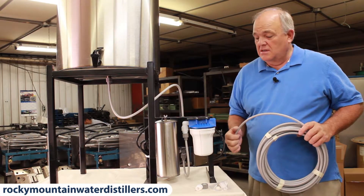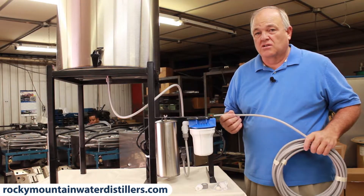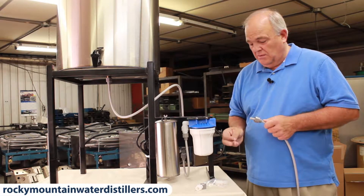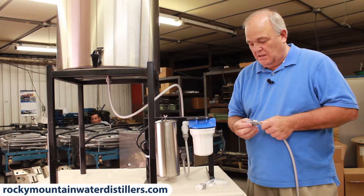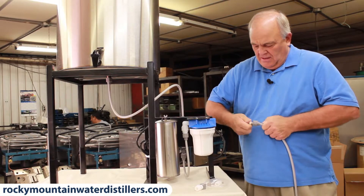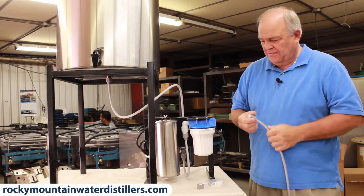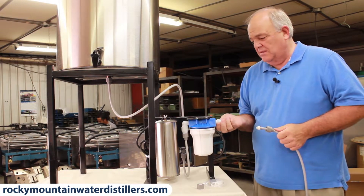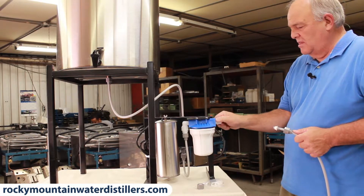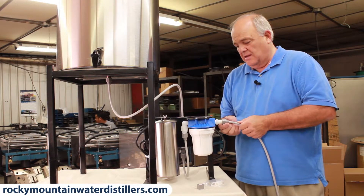Previously to hooking up to the filter, I like to have this PEX line run to the faucets in the house, so this is the last connection we make — and it's virtually the same as what we've been doing. Put the locking nut on first, then put the little lock ring on with the teeth pointing out. Then put the seal on. Now insert this nylon bushing into your pump — make sure you get that threaded correctly, because if you get it cross-threaded you've got a little problem. Then insert the seal onto that pipe fitting.